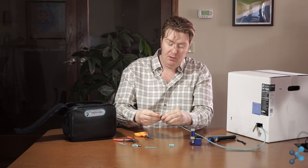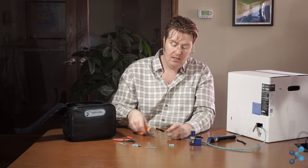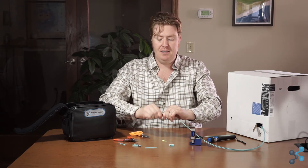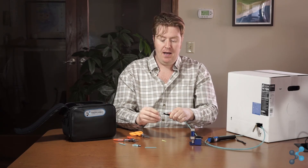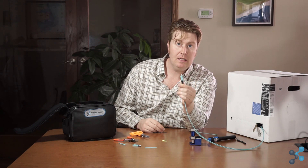At this point, now that I've given it a couple of turns, I can cut off the excess Kevlar, clean up the fiber connector, finish screwing it into place, and then put the outer jacket back on. Once I do that, I have a nice, clean, terminated strand of fiber.